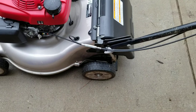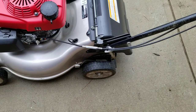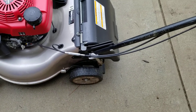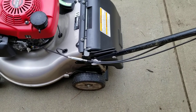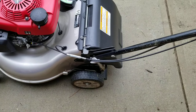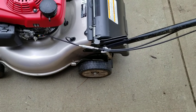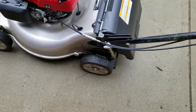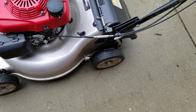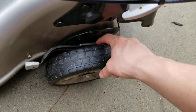I am going to go ahead and order them to see if it'll help. The new ones are identified by a little paint mark on the side of the height adjuster, and the ones I found on e-replacement parts had the little paint mark. It's a pain to do, though. I've taken it off to sand it several times and it helps for a little bit, then like two months later it's seized back up again — no matter if you spray WD-40 on it after every use. I used to spray a little can of WD-40 right down into the bushing and it just doesn't do anything.